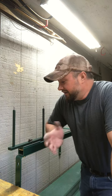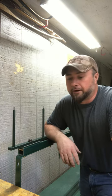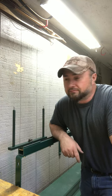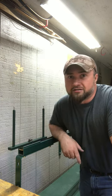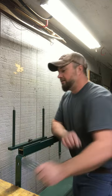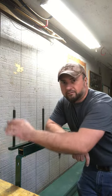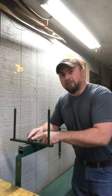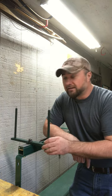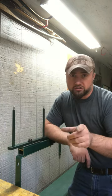It's simple to make. If you have a hacksaw — it's not as precise — but a hacksaw, a grinder, or a regular bandsaw, you can cut all your pieces and drill your holes. Get a friend that knows how to weld to get these welded, just be careful not to get them too hot or they'll warp — you want these perfectly straight. These have to be perfectly straight to one another, and this part has to be square. If you don't get it exact and one side is off, it will cause peep rotation. Make sure they're even, but it's very simple to make.